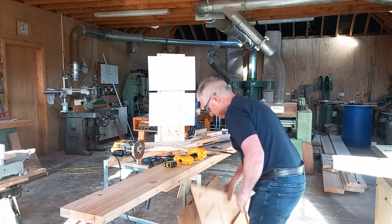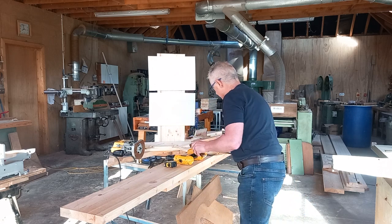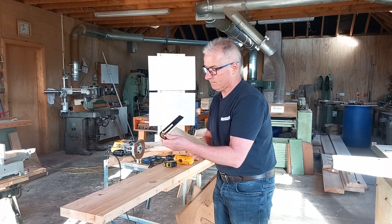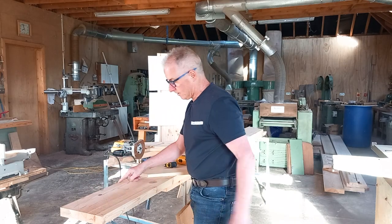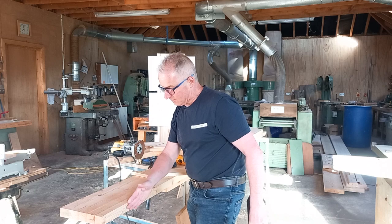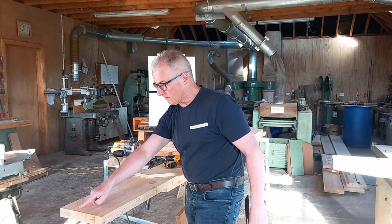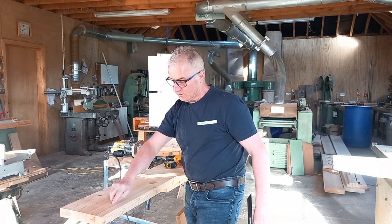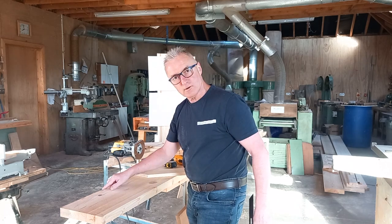Just to recap, when we start, we pick up our pitch line, this guy here. We apply any line here, measure down the distance for our skirting board, transfer that line parallel to the base edge out to the bottom, done. Put on the pitch line again here, that's the height of your skirting. Bring a 90-degree line back from the pitch line to strike the margin line, and when you bring that back, that is the position of your first riser.